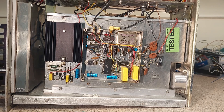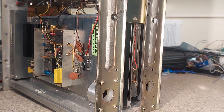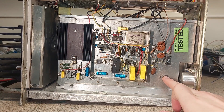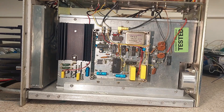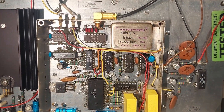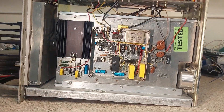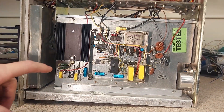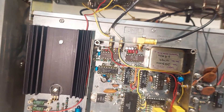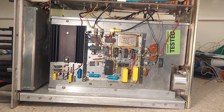As far as the actual transmitter goes, on the side here we have a module made up of three individual boards all joined together on a card sort of arrangement. Down at the bottom we have the UN3-52A. Inside we can see a couple of nice old chips, and crucially a temperature-compensated crystal oscillator — which hints at what this does. There's also a pin labelled AFC, which stands for automatic frequency control, and that wire disappears onto the top card.